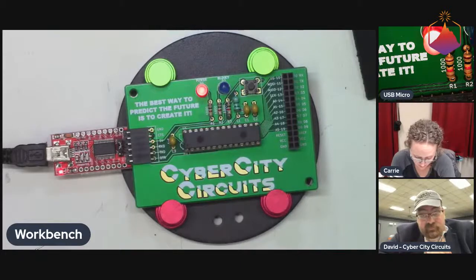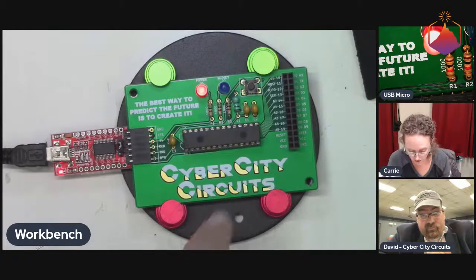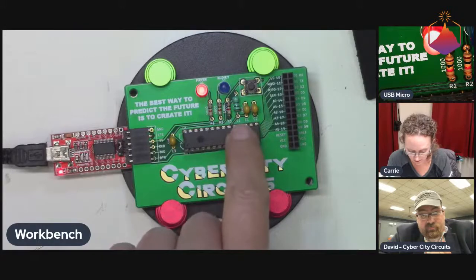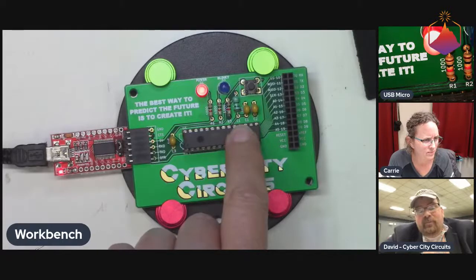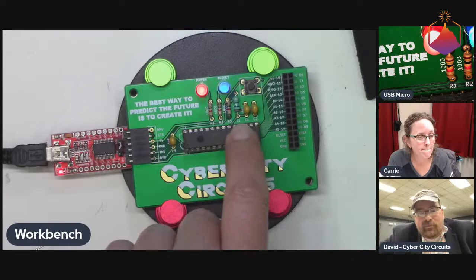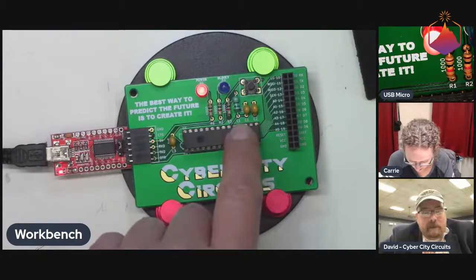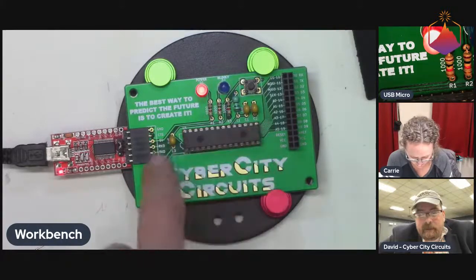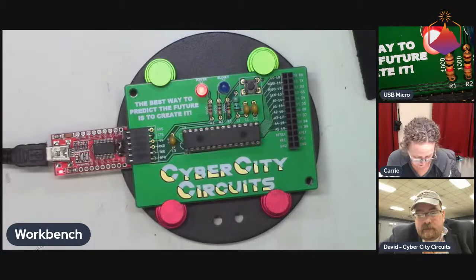If you already have a tiny bit of electronics knowledge, you can see the difference between the three resistors and the one inductor there, right? Is the inductor just power supply filtering? What's that doing? It's the analog channel filtering. It's for the analog reference voltage. Okay, got it. And then the capacitors are all the same values and they're just in the obvious capacitor places. So yeah, not too much mysterious about this.